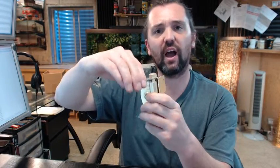Now a hinge like this is going to be appropriate for typical screen doors, something that's going to be in your 20 to 30 pound range. Lighter, of course, works. If you feel that you've got something odd happening there in terms of the weight of the door or maybe the use, go to 3 hinges. Otherwise 2 is pretty typical. Although if you have more hinges, you can kind of share that weight more equally among more than one hinge, but at the same time, if it's a light duty door, 2 is probably going to be where you'll want to be with it. And it's a good quality product, available in several different finishes, if I've not already said that.